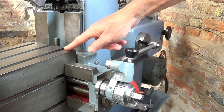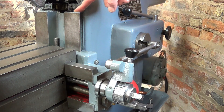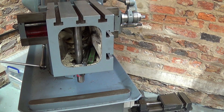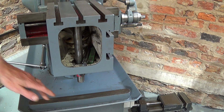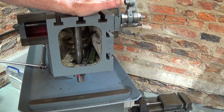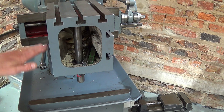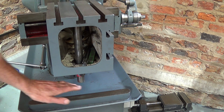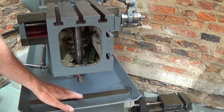The top of the table here will come right up to the top of the dovetail and possibly beyond as the nut winds its way up the screw. Also traversing downwards, there's another danger. This leg can be extended to support the front of the table when making heavy cuts, but it presents an obstacle if the table is driven down. Eventually, however this is set, it will come up against this surface, and after that, if the ratchet continues, something has to break.